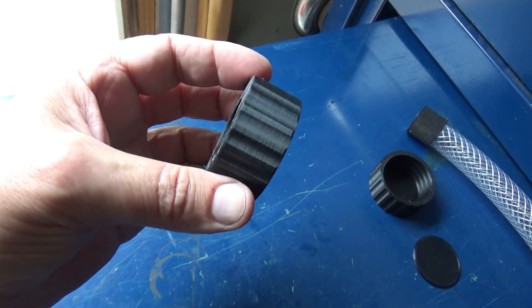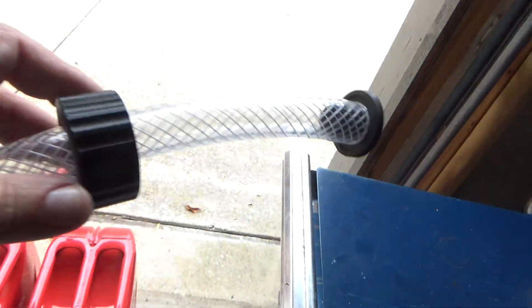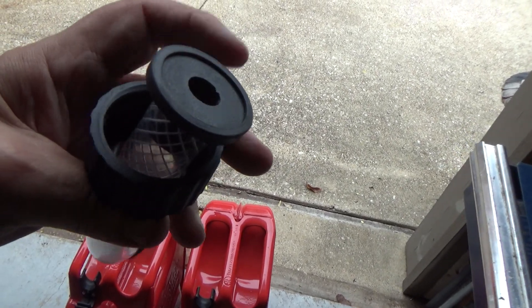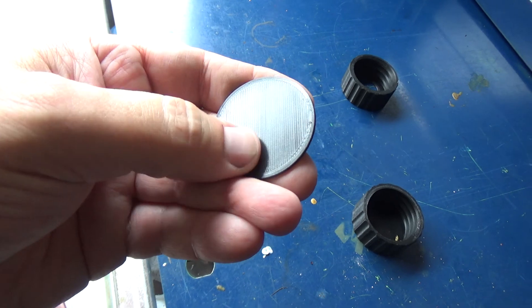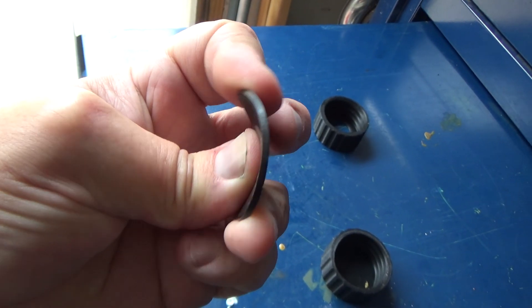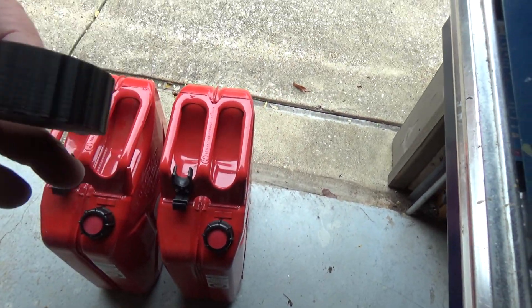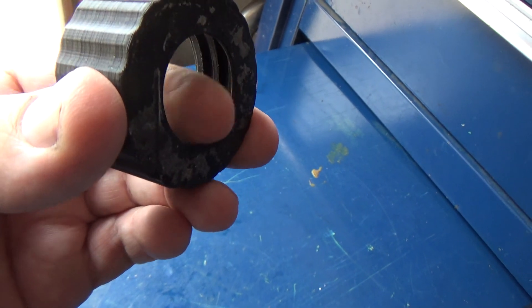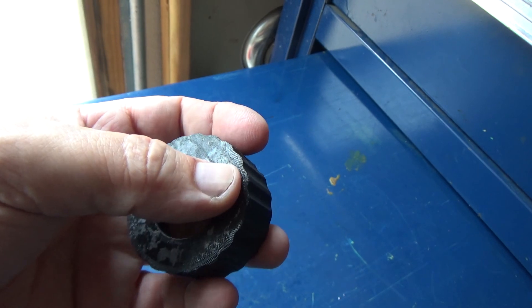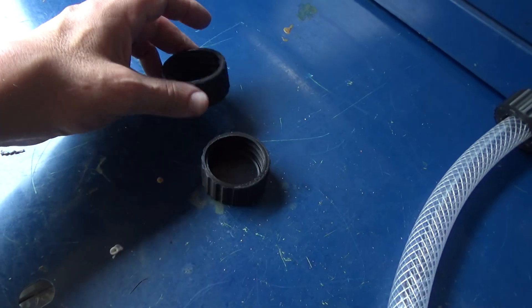I designed them with the proper thread. There's one with a hole so you can put it on your nozzle with my 3D printed adapters and the end cap for the hose. I also did a solid no-hole cap. And I also did what I call a gasket — printed in TPU, which is a rubbery material — that fits down inside there. You can thread this on when you're not using the can, when you've got them in storage. I tried to make the top about a hundred thousandths thick to give it enough strength, and since they're 3D printable you can print however many you need.